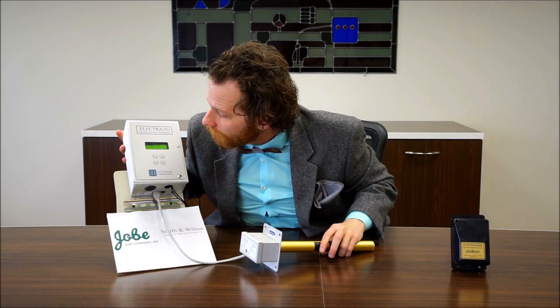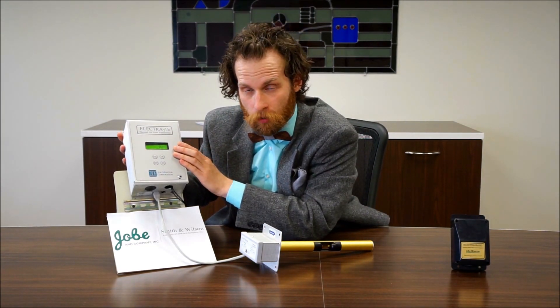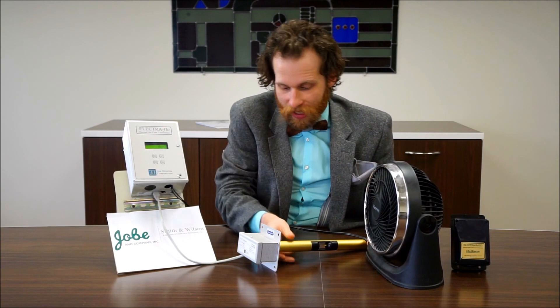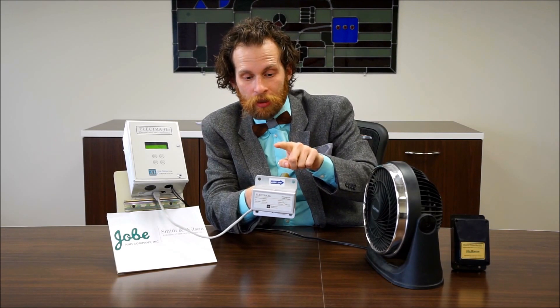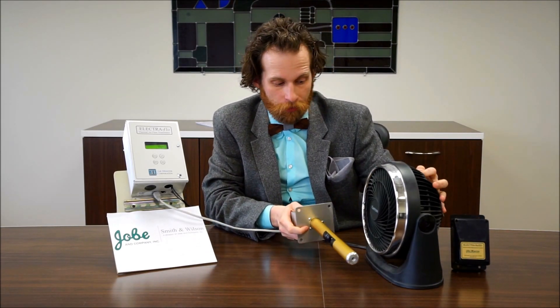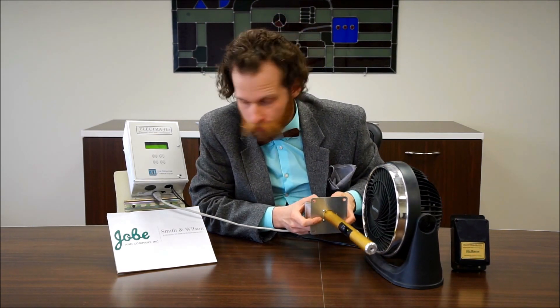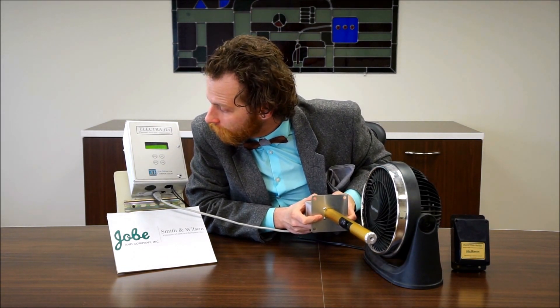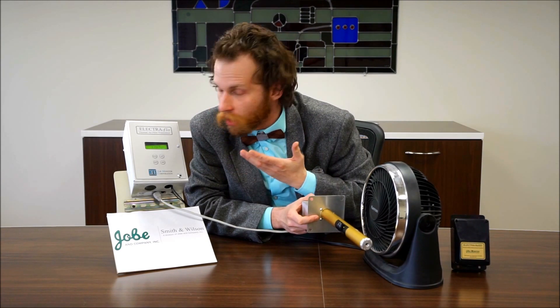We've now just finished warming up. It's telling us it's 78 degrees and there's zero airflow. So let's measure the airflow — we'll take our fan, and one thing to be cognizant of is the airflow arrow on the probe. We want to make sure the airflow is going through the correct way. We turn on the fan, run the airflow through, and very quickly it tells us it's got airflow going through it. As more and more air passes through, it comes up to a reading of just under 1,100 feet per minute.